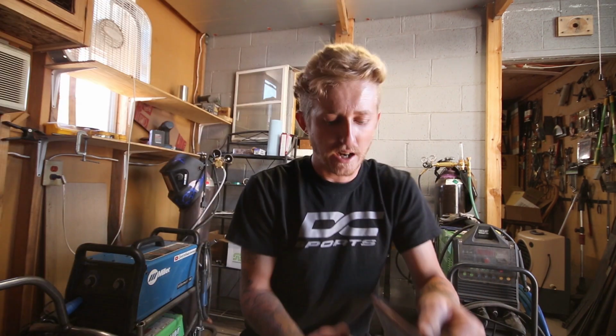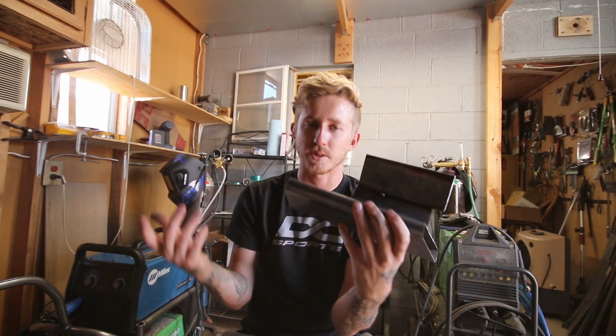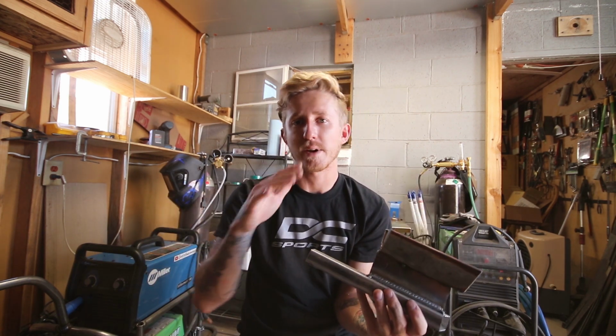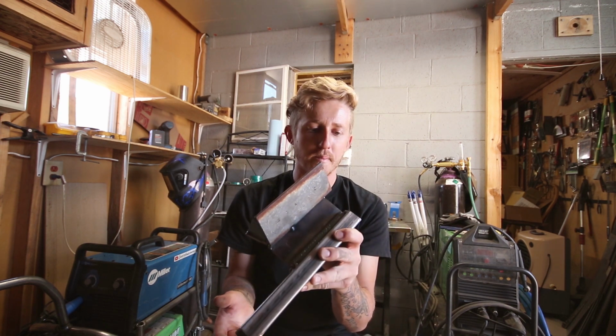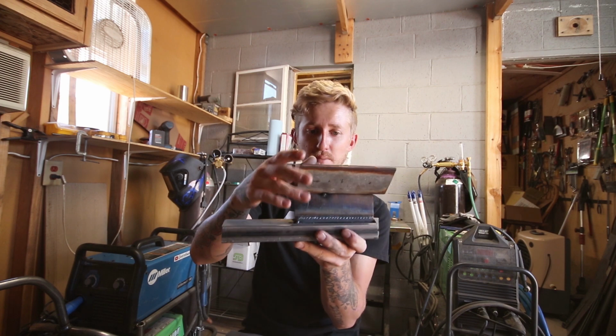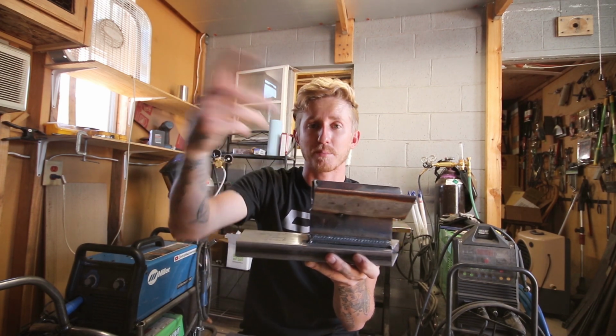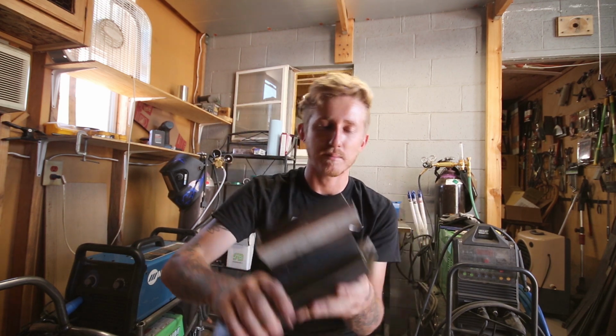And then this is my 25-degree cutting fixture. This is really simple as well. My front tubes, I cut them at a 25-degree angle, and basically all I have to do is set this up against my saw and run my material to this back plate, and then that's my cut length and my cut angle.